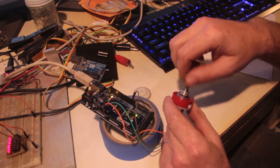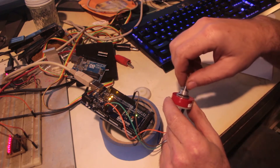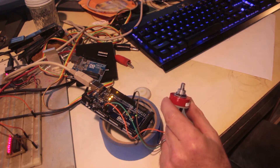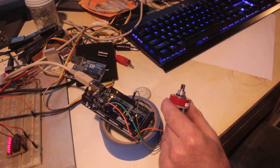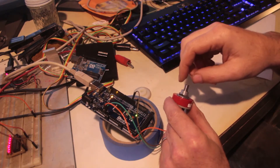The idea is I have this encoder here. It outputs 256 pulses per revolution as the shaft turns. By figuring out the time between each pulse, you can figure out how fast the shaft is spinning. And if you can figure out how fast the shaft is spinning, you can figure out the torque — because if you put a known load on a drill, you can figure out how fast it can accelerate that load. The plan is to have a flywheel, actually a car tire wheel, that the drill will spin up to speed, and you measure how fast the drill can accelerate that flywheel.